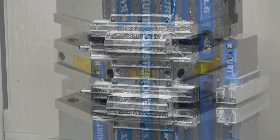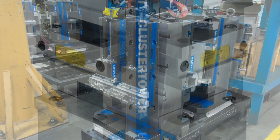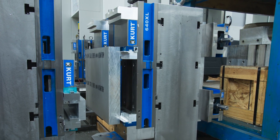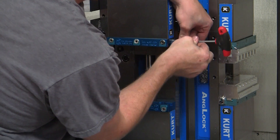With the old jaw setups, operators had to avoid the two cap screws when machining a part feature or pocket into the jaw plate. Now with the Dove Lock jaws, they can rotate them 180 degrees and machine different setups on both sides, which also reduces how many jaw sets are needed. The Dove Lock work stop located on the master jaw also allows for quick and repeatable location.